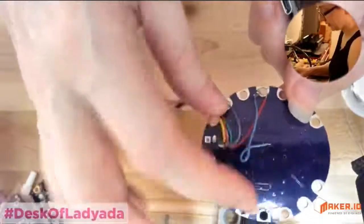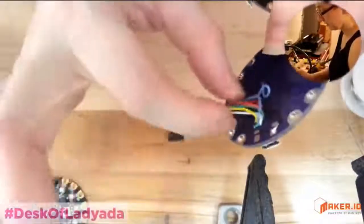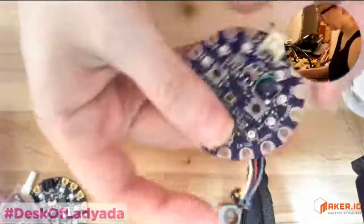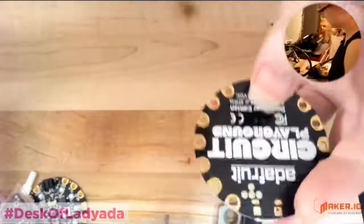I had a wire that needed to be bridging, and I needed a 10K resistor, so that's kind of a process. And then I soldered on the ISP header myself, just using small wires, and that's how you program the chip, because you're going to need to program it or connect to the debugging interface. You do have to think about how you're going to program it in manufacture. That's something that you have to think about.